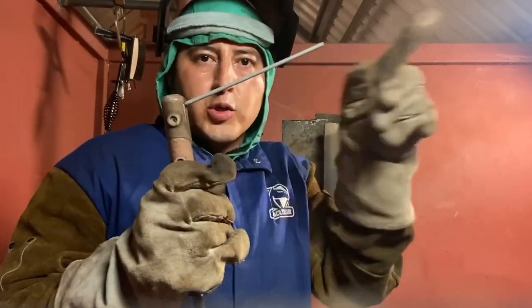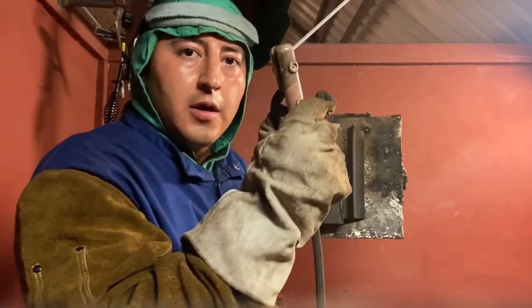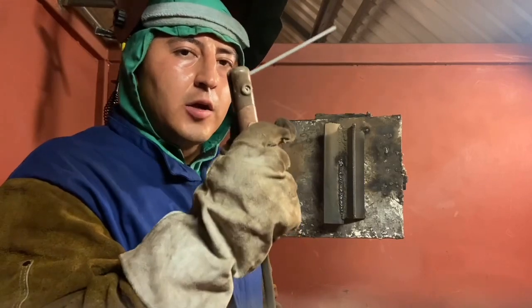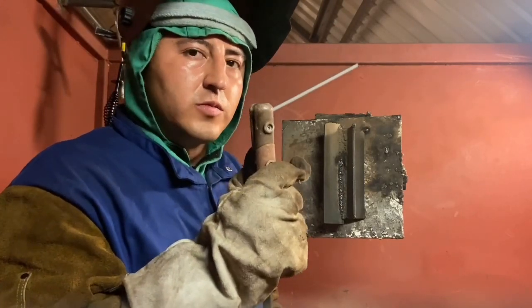I like having my electrodes angled up a little bit. I'm going to reach and restrike it from the top. So I get to my transition — whip side to side, go up, come down, whip side to side, whip out, come down, side to side.